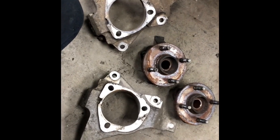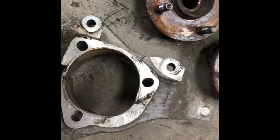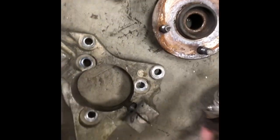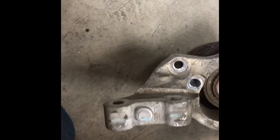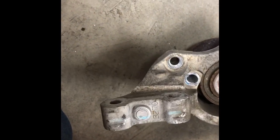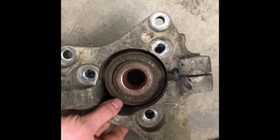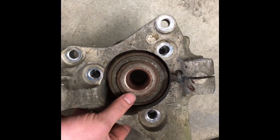As you saw, we were milling out the holes in the spindles. You can see here they're egg-shaped so that you can fit the cobalt hub in. This is basically what you're trying to do — egging out those holes so that you can get the bolts in for the cobalt hub.